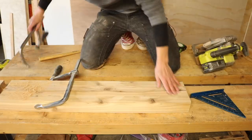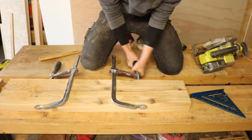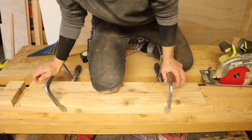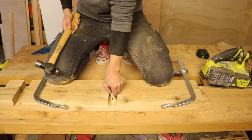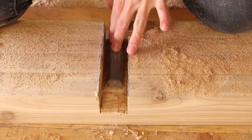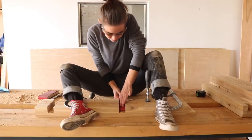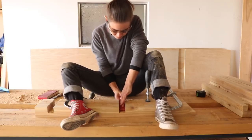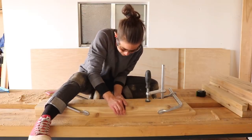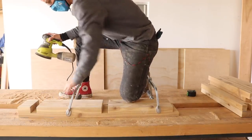I repeated the process on the opposite side, but this time I knew I wanted the shelf to sit flush with the legs, so I pushed those cuts all the way to the top. Third shelf — you know the drill by now. I used a chisel to break off some of the bigger pieces and then did a lot of sanding. I should have unclamped them first because it would have been way easier, but you know what they say about hindsight — makes an ass out of you and me. I did take advantage of them being clamped together to do a bit of sanding.